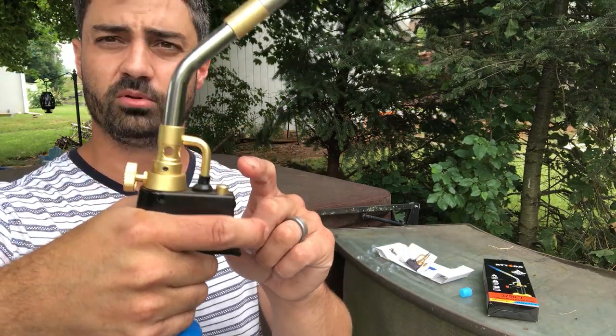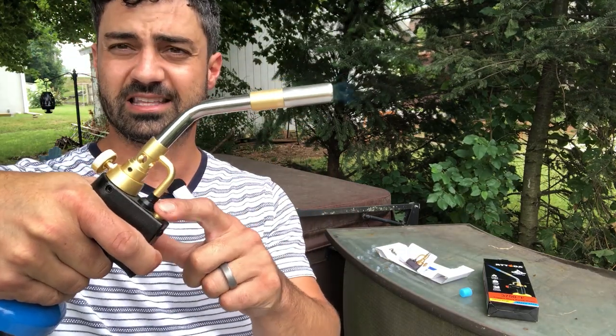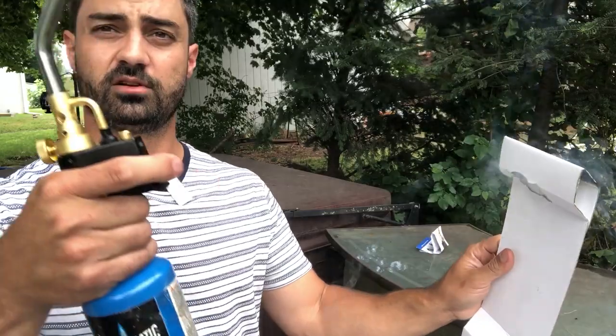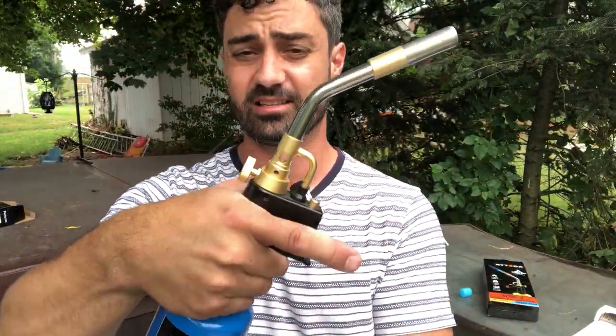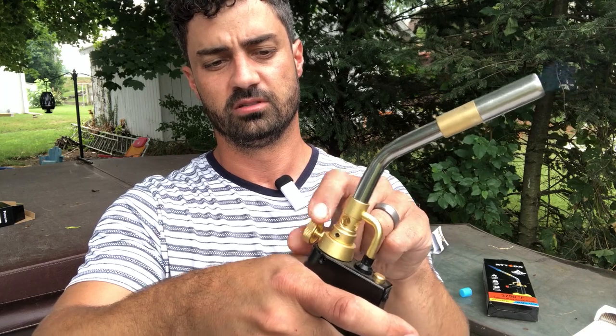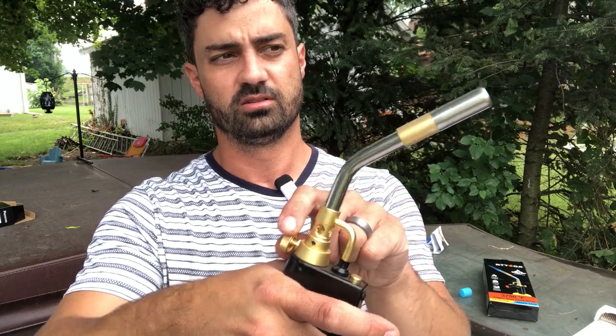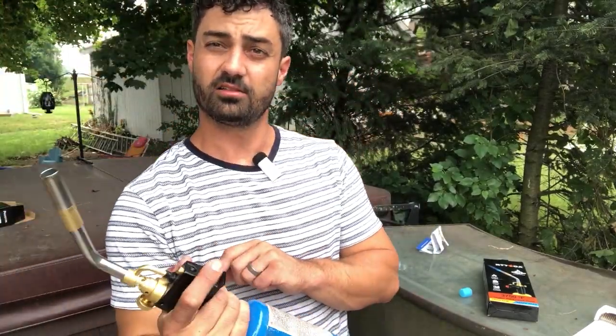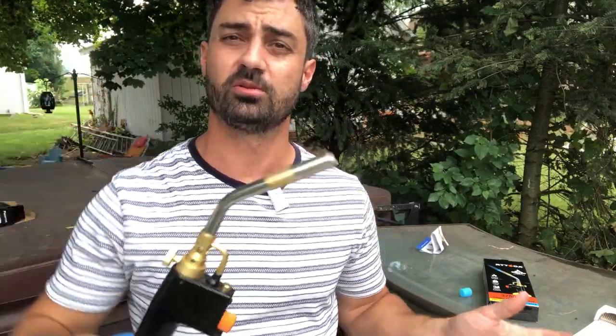This little brass button here — if you pull this in, turn it on, press that in, let go, it stays on. If you click the orange button again, it releases that lock and then lets it off. You can adjust if you want more or less flame — you can really turn it back, just get a small flame. That is staying lit. And at any angle, that's the other thing with the other style: when you tilt it over too far, it stops blowing flame out. You can see that was blowing flame out at any angle.